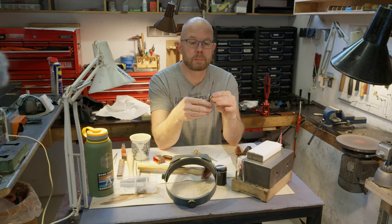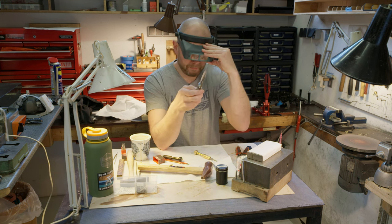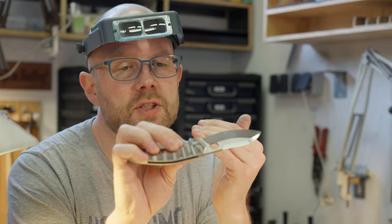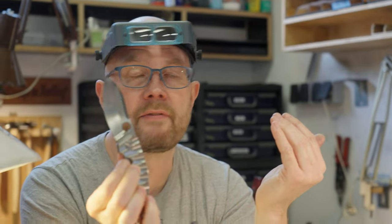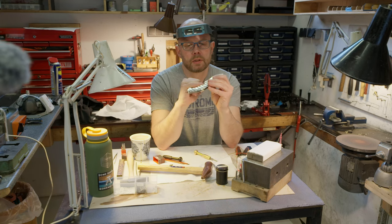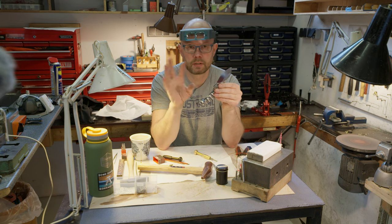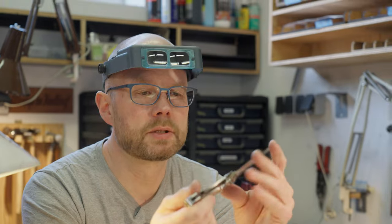Actually, this has the perfect lockup. No wait — this needs to be dialed back five hundredths of a millimeter, which in fractions I have absolutely no idea. So for this specific one I will change the lock insert to the next step up, and for the next four I will adjust my dials back five hundredths of a millimeter, maybe four.